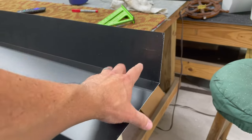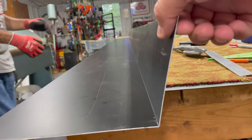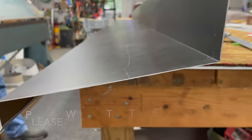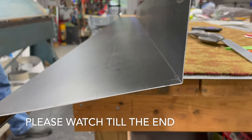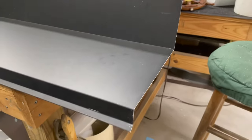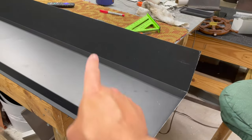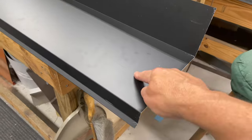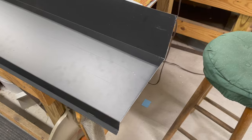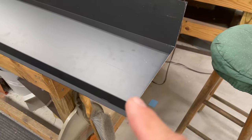So we're making him this flashing. He's going to take the siding off and then nail this to the deck. It's got a little bit of an angle, so he's going to raise it up to make it level so the water will slope off and won't gather there. He'll nail that to the wall, and then he needs to turn this corner — it goes across the front and then turns back. We're going to cut a miter and this piece will have the tabs on it. I'll show you how I do that so it wraps the corner with the tab.